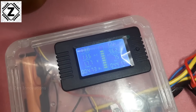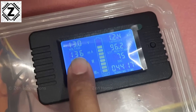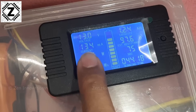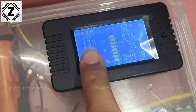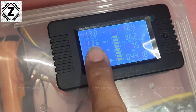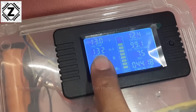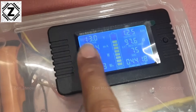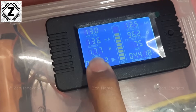As you can see, the battery voltage right over here is 13 volts, and the power consumption — the standby or no-load current of this device — is pleasantly very low. This is just 130 milliamperes. Keep in mind, this is not 1 ampere or even 1.3 amperes — this is just 134 to 138 milliamperes, that is 0.13 ampere. And if you multiply these two values, the product comes to 1.7 watts.